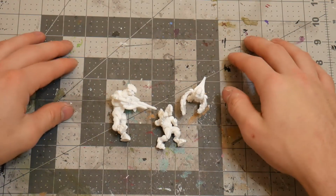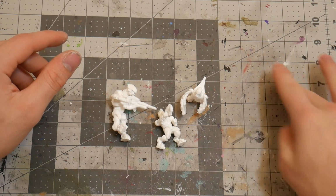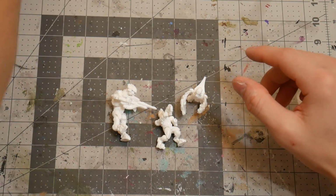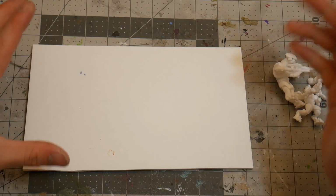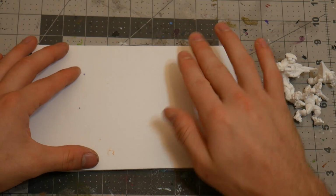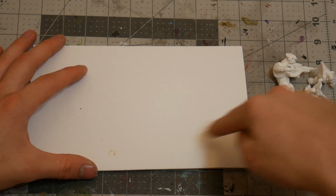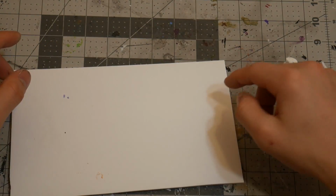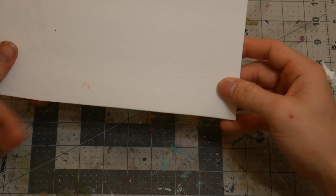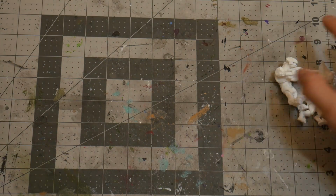And yeah, so that's really it guys. I hope this tutorial kind of helped a little bit on the material I use, how to do it. I know I didn't show you perfectly everything, but let me run over it again. Foam core, okay, if you want to embed something, put some clay down, embed it very gently, cut around the edges, put foam core around it, and then glue the outside of it, pour in your silicone, wait, and that's literally it. It doesn't take too much. It's not super hard to do, which is great because it makes molding very, very nice and easy.